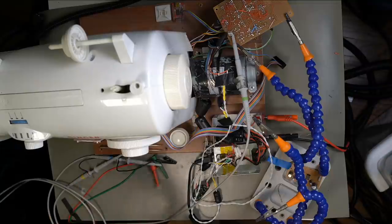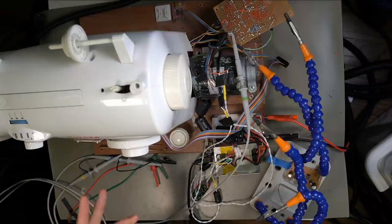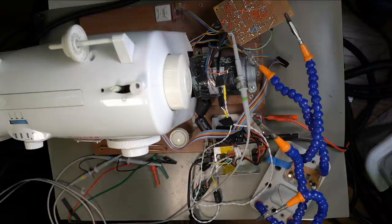I was thinking, we just did all the EMI things, and the ringing looks great on the oscilloscope, and the power rails look pretty stable, and there were no longer massively obvious problems everywhere. But we were still getting pretty much the exact same crash symptoms. Sometimes the LCD flickers and stops updating, or goes into weird mode, basically receives corrupted data of some sort and stops working.